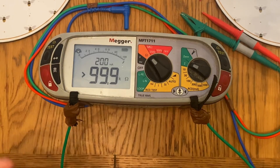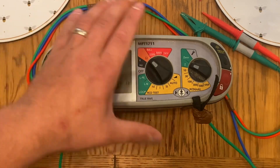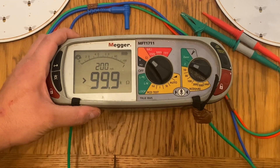The tester is actually being used as a low reading ohm meter. So when we spoke about earlier that an exam might not want you to call it a multifunction tester — this is what we're talking about. You might get a question in an exam about what test instrument is used when conducting continuity of your CPC. The answer is not going to be a multifunction tester; it's going to be a low reading ohm meter. A multifunction tester just means all of these different settings actually apply a different type of test instrument, all in one unit.